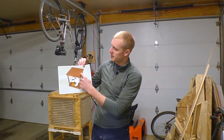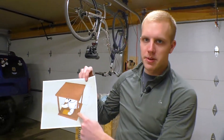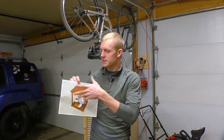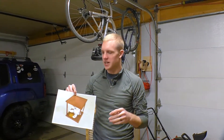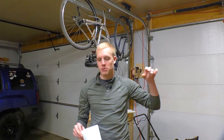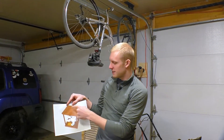The first thing we're going to do is focus on making the top lid and the bottom base. Originally I was going to build this out of solid cherry, but because of expansion and contraction issues I'm going to use some cherry plywood. I was fortunate enough to find some at my home center — there was a tiny little corner at the bottom of one aisle with quarter-inch cherry plywood. I'm going to get a big sheet and cut out six of these little squares.